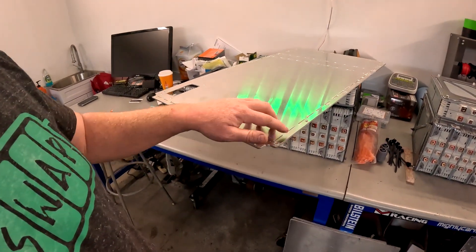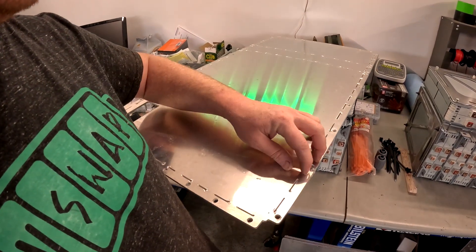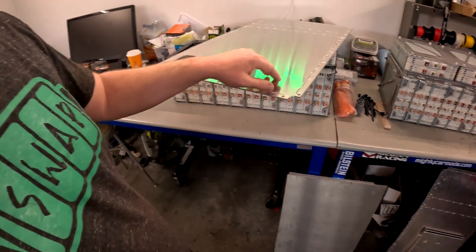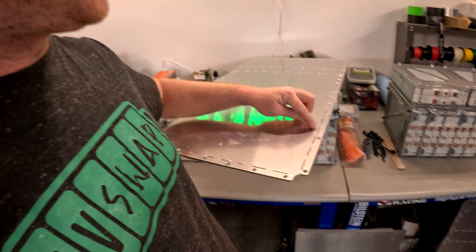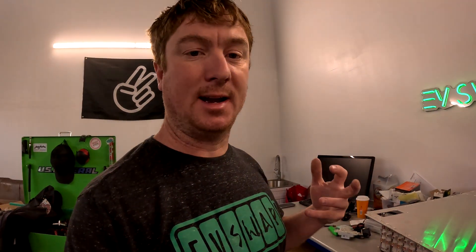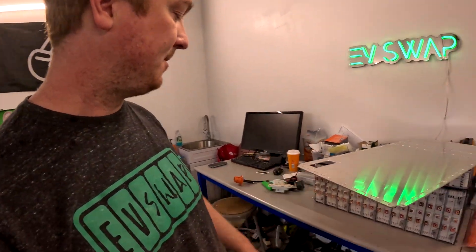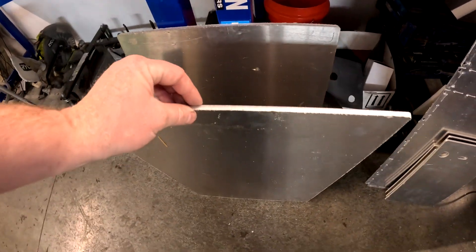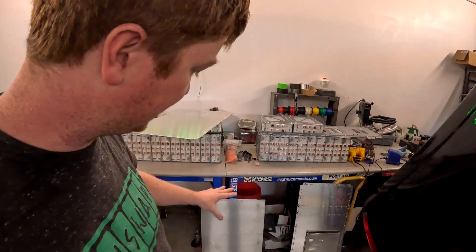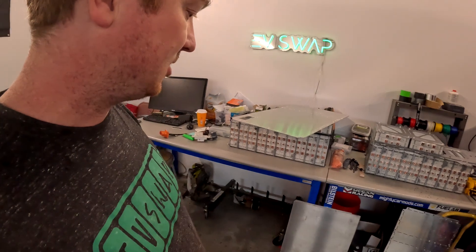So that's it. This is what I'm going to be working on this coming week. We're going to have to clean this up — all this little splatter and stuff. We'll get all these bent, and after I bend these I will weld all these gaps just to get the strength and the waterproofness back. We have the nice thick quarter inch aluminum bottom plates — that's what all the battery weight is going to sit on.